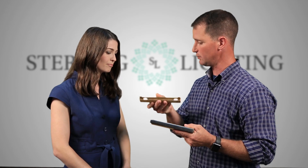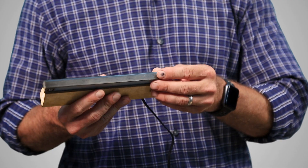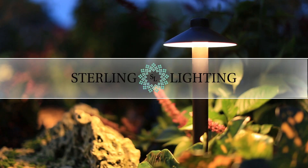This fixture actually fits perfectly right on the junction box. So this junction box can be built into the concrete or masonry steps, and then the fixture fits right on top of it. The connection has to be a tight, small connection — we typically go with a waterproof inline connection — but the fixture covers up the space to allow easy access in the future. It's so great to see all the innovation coming out of Sterling Lighting. To find out more, you can visit sterling-lighting.com or give us a call.